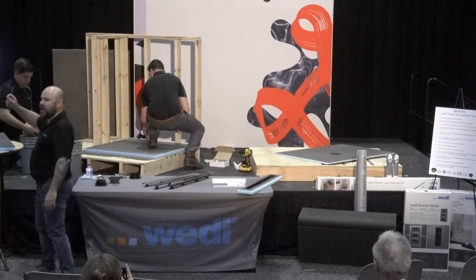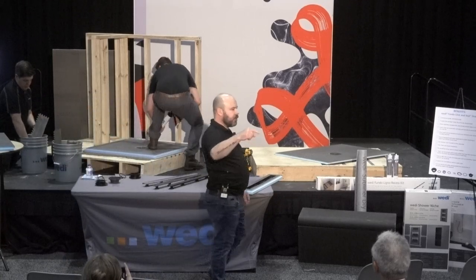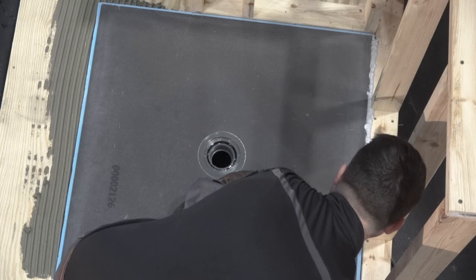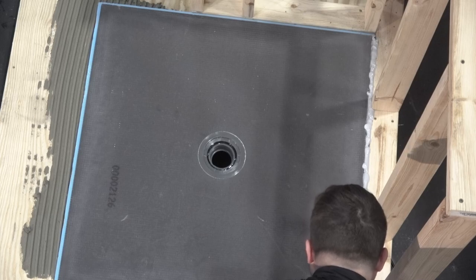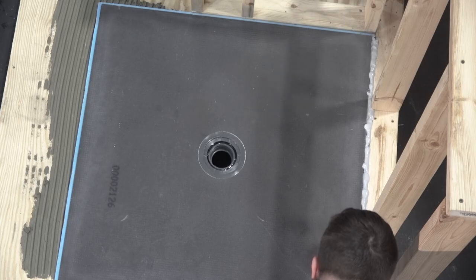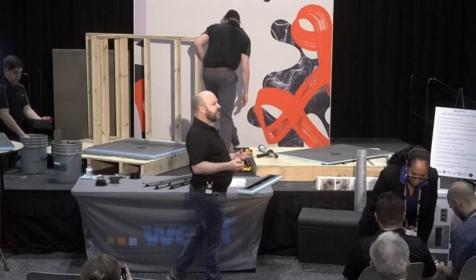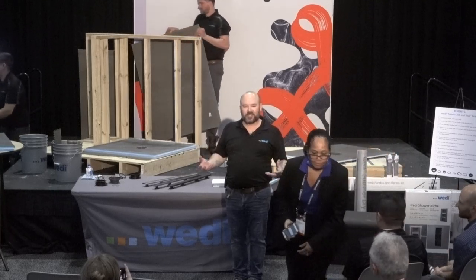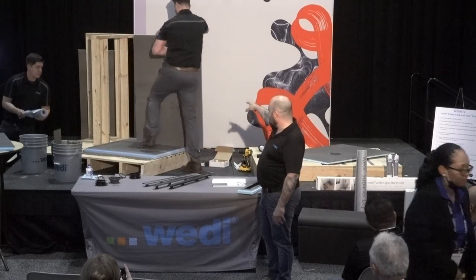What Greg is doing now is applying a half-inch bead of sealant in the channel that runs around the perimeter of the shower base. If you have to modify your shower base — maybe cut it down or extend it for an odd-size shower or odd drain placement — you can cut down this shower base and simply recreate the channel with a circular saw and a razor blade. With our extension panels it's equally easy to extend the base. Not a lot of tools or thought required, and you set the extension in thinset just the same. That half-inch bead of sealant goes in the channel.